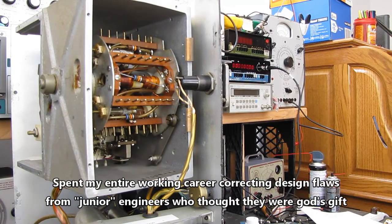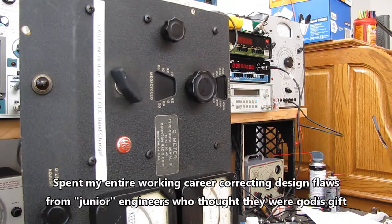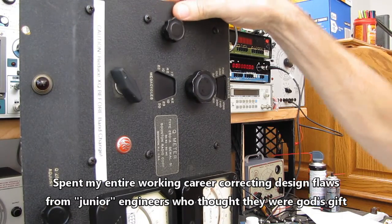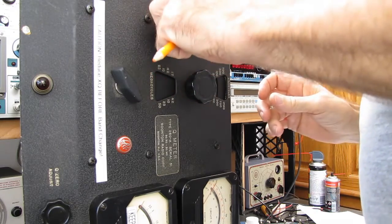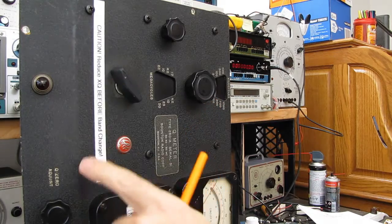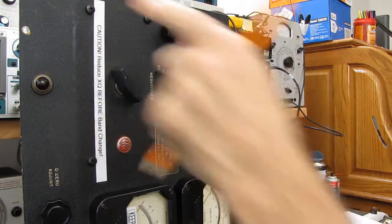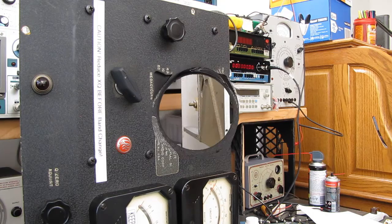So what I'm going to do, actually I'll have to pull 2 knobs, I lied. Oh, maybe 3 knobs. No, that's a pot. No, that's a trimmer, that goes inside as well. So I'll have to pull 1, 2, 3 knobs, 6 screws, and 2 connectors, and that whole block should come out so that I can get to the 2 screws that are behind this panel. So let me get that done, and we'll pick up from there.